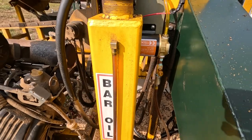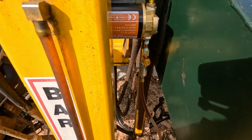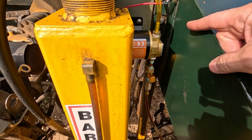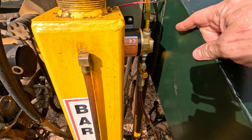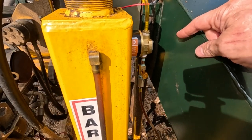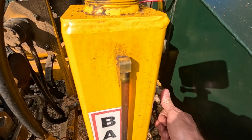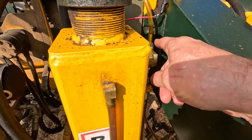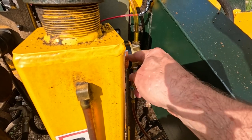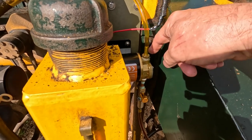One final thing to say. You'll notice that I put the control valve on the inlet side, and there was a reason for that. Gear pumps — if you look at a larger gear pump, one that's maybe 100 gallons per minute, they have built-in relief valves. This one does not have a built-in relief valve. So the reason I put the valve on the inlet was to restrict the flow going in. If you restrict the flow going out on a gear pump, you can break the pump — you can snap off the key, you can burn up the motor. So generally, unless you have a relief valve, you don't want any restriction on the outlet of the pump.